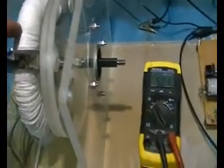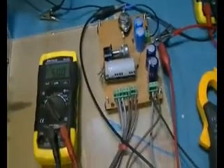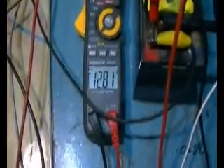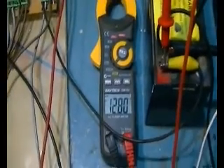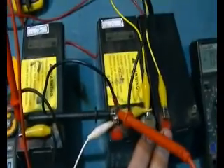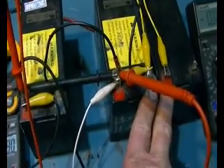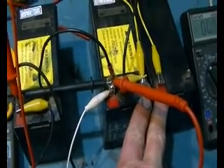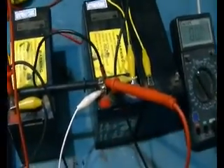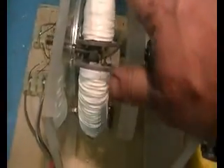This one I've wound a bit differently to try and stop that, and it's had the totally opposite effect — this would be the fastest I've ever seen a battery charge in all my times playing around with these units. This of course is our charge battery. I'll be running it on 24 volts because it seems to draw a lot less current, runs a whole lot smoother, and battery voltage doesn't drop very much at all.